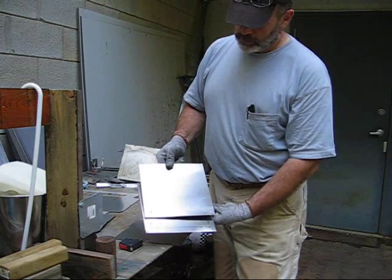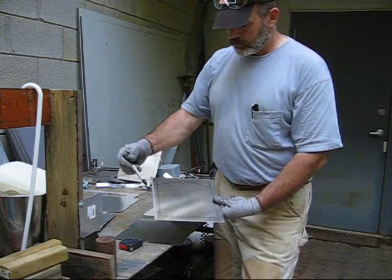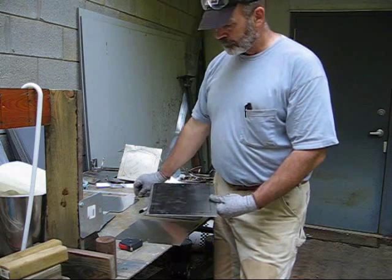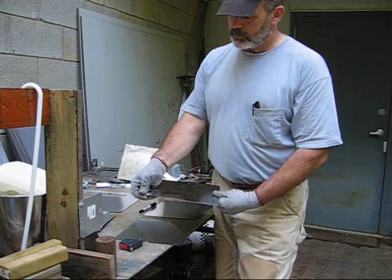The holes alternate on the bottom. I cut little tabs on the corners with tin snips — just cut a little V out of here. You want to make sure you keep those at least a quarter inch wide. If they're more narrow than a quarter inch, your terminals won't stay on.